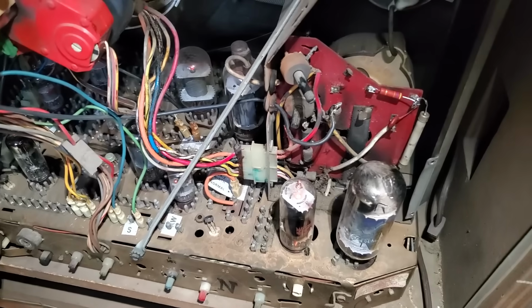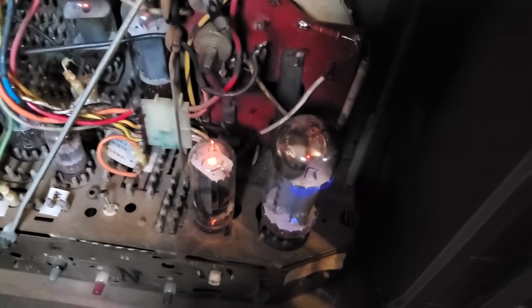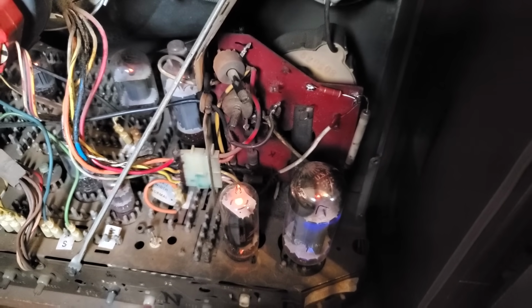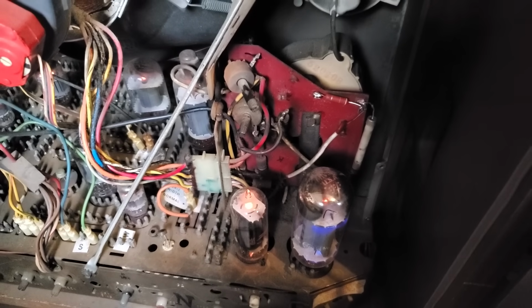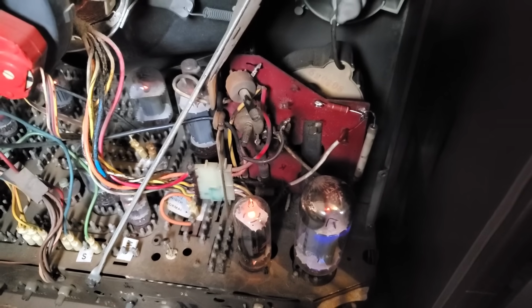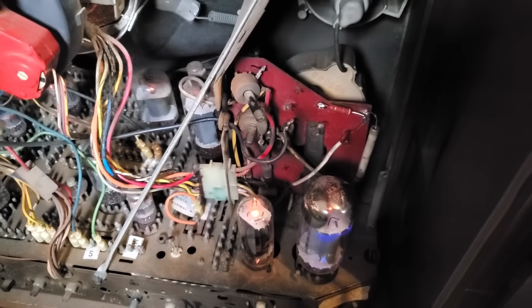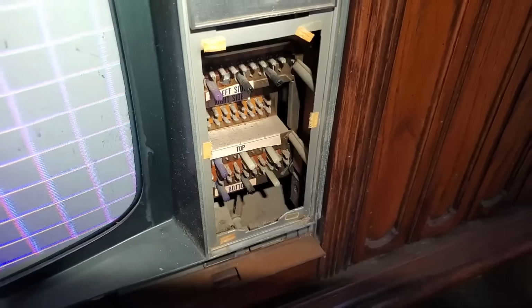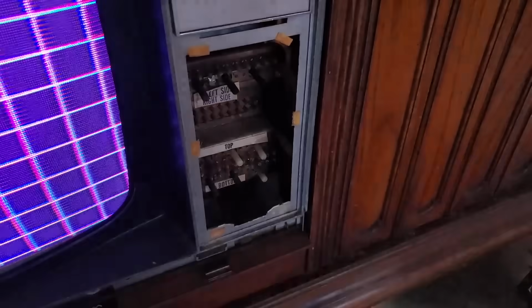And I think we are going to straighten the transformer thing out. I think he might make and send me a couple more. Plus, I'm probably going to take the other one apart and split that tie point up and bring 2 wires out so I can configure it the right way. I got the center convergence done. Now I want to see if I can adjust this, which will tell me the transformer's working right. Putting the convergence panel here is probably the most intelligent thing, and it all works. You see, it all works.